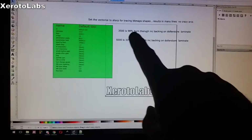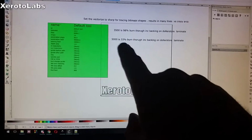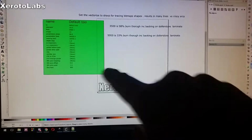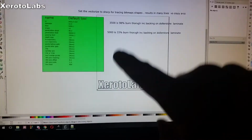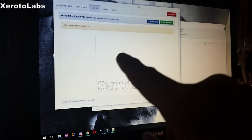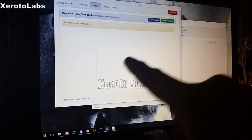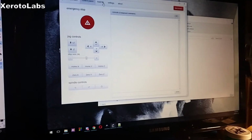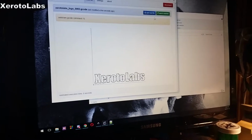I've been using Inkscape and trying to test the different feed rates. Now, don't worry about those feed rate numbers. I'm using custom firmware, so I've got pretty fine-grained control on my feed rates. Anyhow, I just used the Inkscape plugin to turn that into G-code, which I pull up inside this wonderful Chrome extension that is a G-code sender. It gives you all the usual stuff you'd expect. You load your file, and then you can send it directly to your machine once your machine's set up, and mine is.